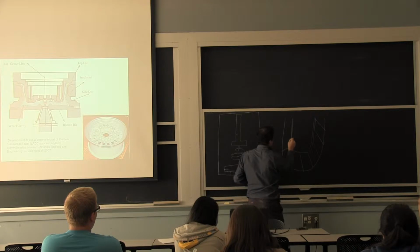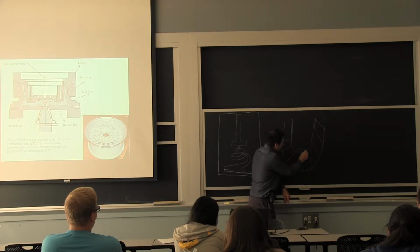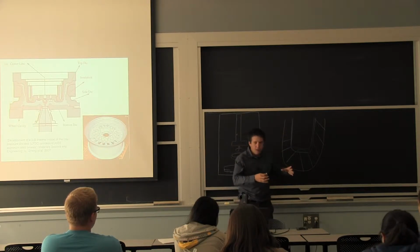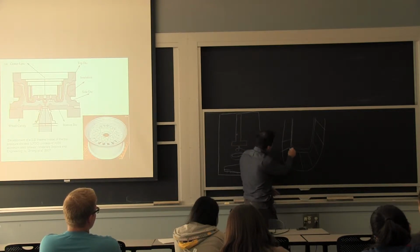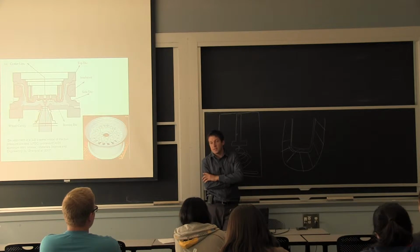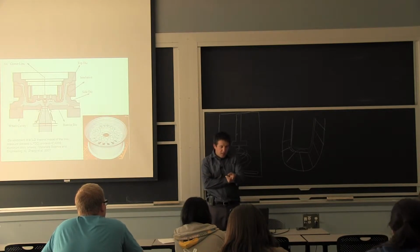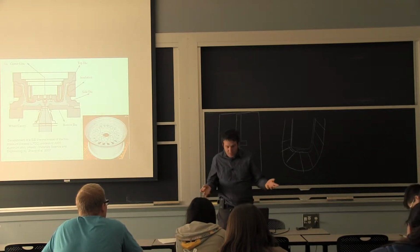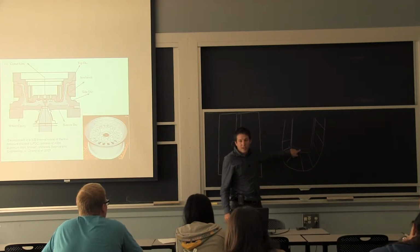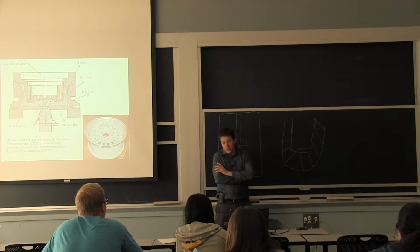you almost know for sure that this will become completely solid before you solidify through the thickness here. So this is going to take a lot more time than this wall, and it will try to reduce the diameter. So you get a lot of bending stresses in those corners that can initiate cracks if this is not tempered or doesn't have anything special added to it. So the same effect is applicable to the wheel here, even though the geometry is more complex. I think you can understand there'll be some sections that will take longer, and they'll activate a spring because everything else is already stiff. It happens in welding.